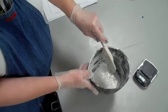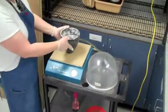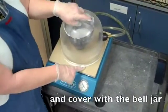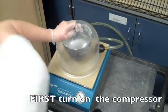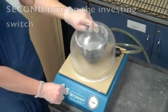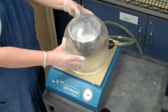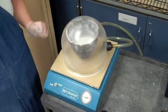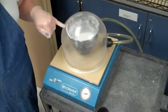When you don't see any lumps, take the bowl to the casting machine. Place a rubber bowl onto the casting machine, put the bell jar on top using the brown rubber mat, and turn the compressor on. Then switch from cast to invest on the machine — notice how the pressure goes up. The bell jar should be secure, and we're going to wait until we see little air pockets popping out of the investment.